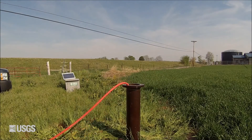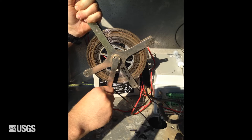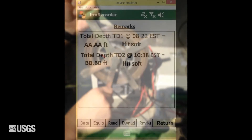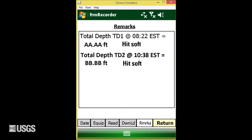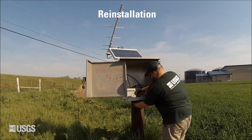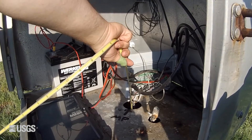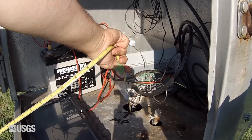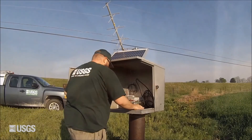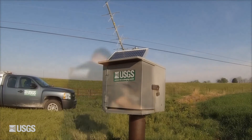Shut off the air compressor and remove the hose. Final inspections. Measure and record the final total depth of the well using a weighted steel tape. If all of the debris at the bottom of the well has been removed, the final total depth measurement should generally be in closer agreement with the original driller's log. Re-install gauge structures and all equipment. Make consecutive tape downs to the water surface using an E-tape until two measurements agree within 0.02 feet. Record these measurements in your field notes. At continuous recording sites, set the recorder to the tape down to water surface measurement and start the recordings and transmission of data.